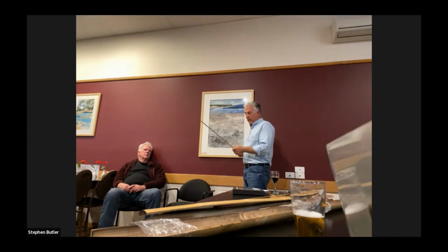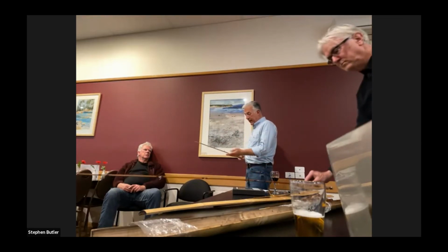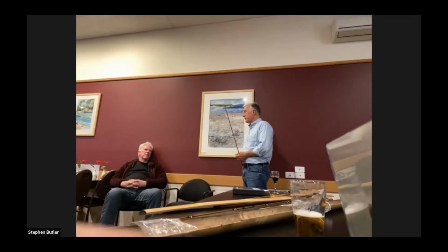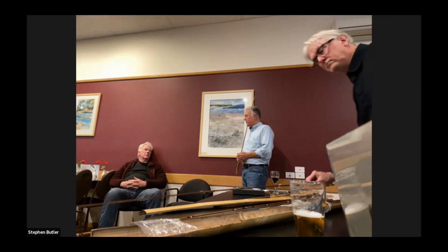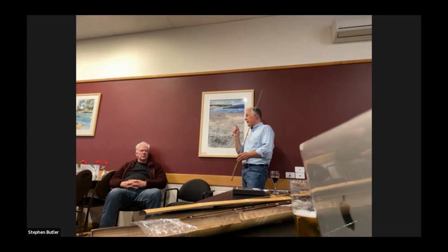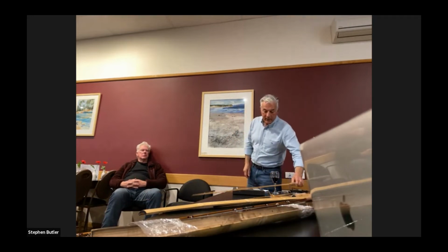That's the first thing that we rod makers zero in on. Some faults would be hidden. They might have used a bit of cane that's got a blemish or insect damage, and they've covered it up. Some might be in the measurement itself, compared to the original recipe. The difference is 20 thousandths, which isn't that much actually, but we do strive to get within 5 thousandths and even less. An expert rod maker like Nick Taransky wouldn't let a rod go out of his shop unless it was 100% accurate. If it's meant to be 240 thousandths at that point, it'll be 240 thousandths on each section. That's the standard that we all aspire to.